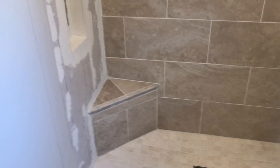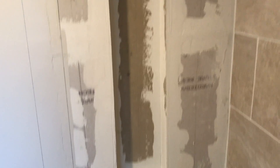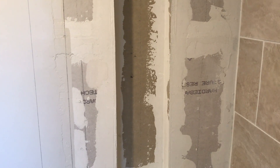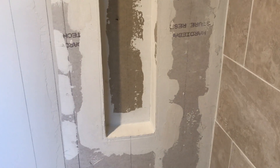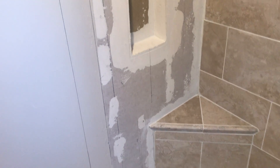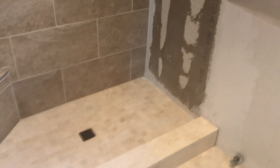Now it's on to the two walls — both sides. We'll start with this wall first. I'm going to take that chair rail around this niche, and that'll be my framing. The face of the niche is going to be in this marble, set up in a masonry pattern — it's two by four inch — really nice color. We'll get back to you when we see that whole wall done. I think it's going to be really nice once everything gets done, especially when I run that chair rail across this wall just below the window over the sink with this color. I'll tile out this wall next and you'll see my procedure for that.